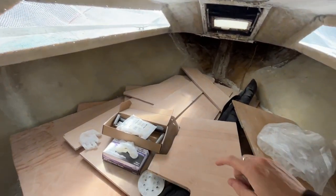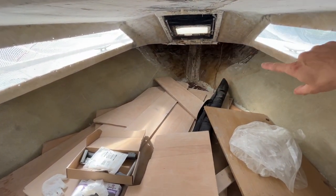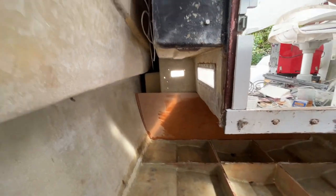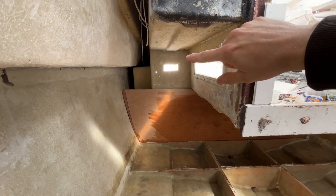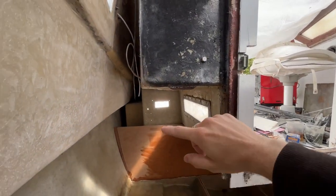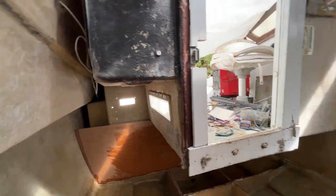So what I'm thinking is keeping the jack there until I've done this wall, the anchor locker wall, and even that wall down there, because what I don't want to do is bond it all up together now and then come up to here, jack this up, and it actually needs to go up a bit and it might break the seal. So what I might as well do is jack it up, bond it, and get most of it done, to be honest,